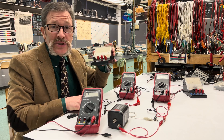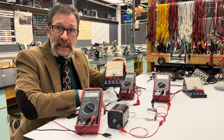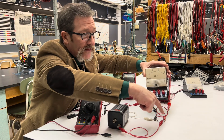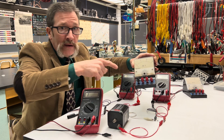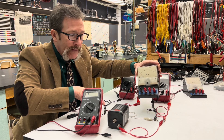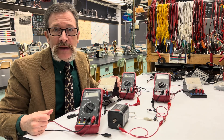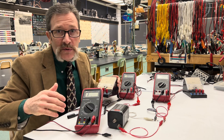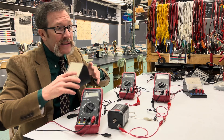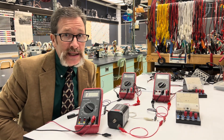This one essentially leaks. When I put one of these meters — if this is a 10,000 ohm resistor and this meter is roughly 10,000 ohms — we're going to have leakage going through the meter to the point where the diode really doesn't even mean anything in the circuit. It's really two 10,000 ohm resistors in series with a six-volt battery. Hence, you would get about three volts and about three volts. That's the importance of using the right meter and understanding how both work.